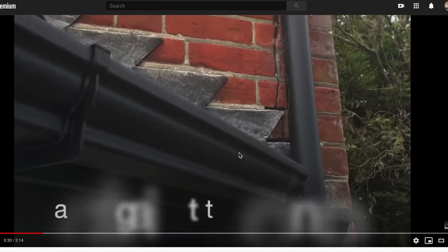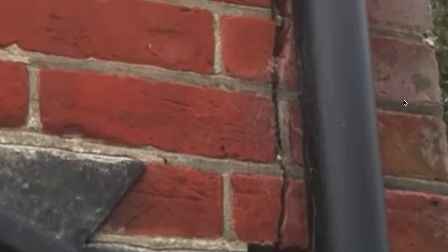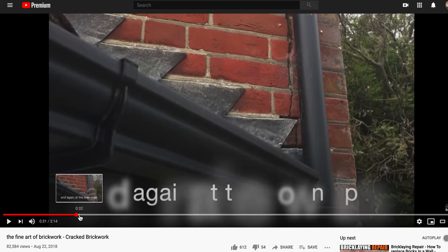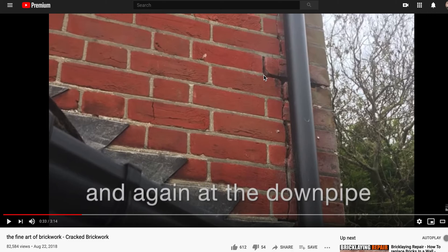Let's look at the right corner and tie it all in. This is your right corner. As you see here, we have this corner wall lining up pretty great, but we've got an inward motion here. This is facing us more forward than this. So that's also a mini column right here below. It doesn't take much water to cause an effect on this entire wall system, especially with the header being installed, making it a weaker plane.